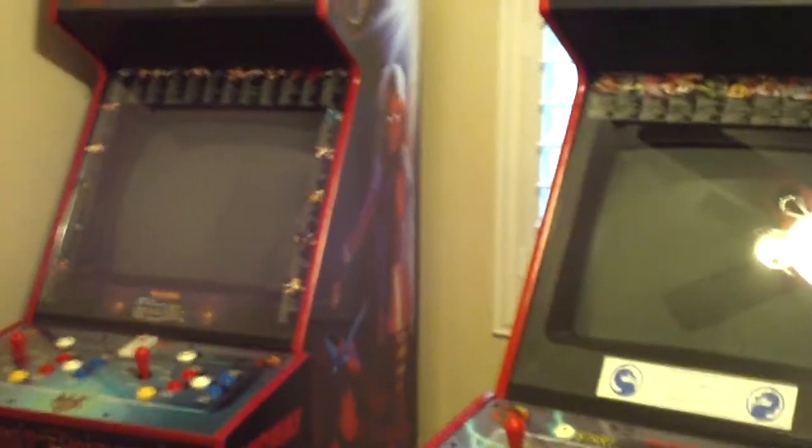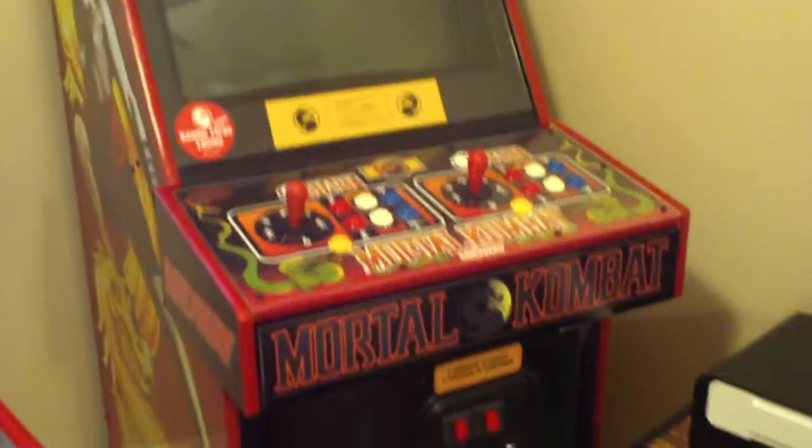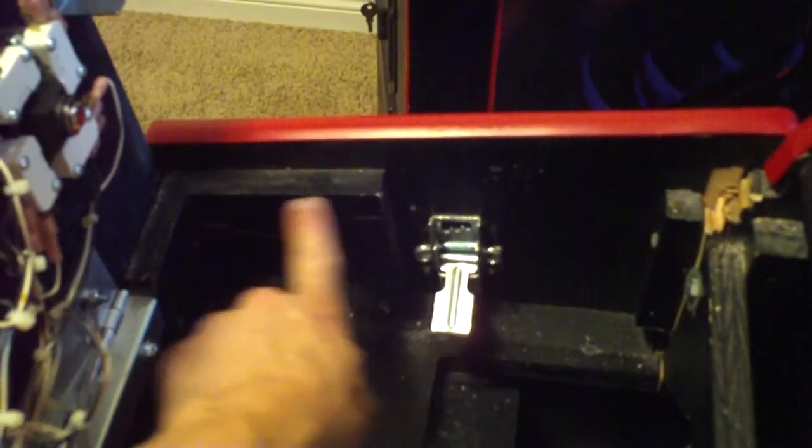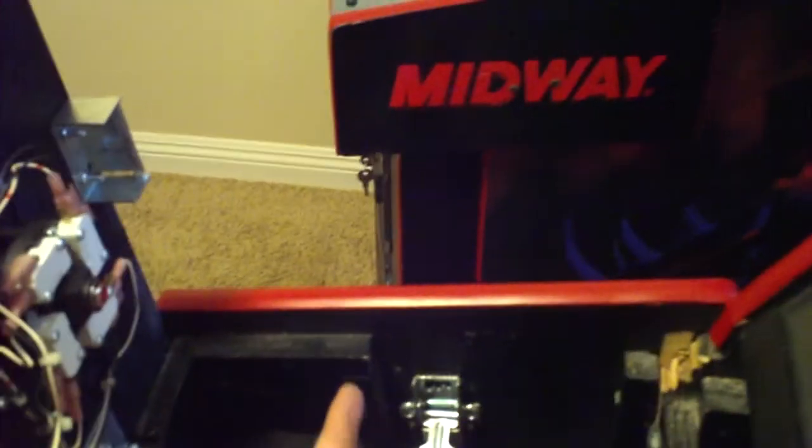But for informational purposes, the control panel is put together with an air gun, I'd imagine. That's the way I'd put mine together here. I actually took the old control panel apart, and there's just little brads in there from a nail gun, and glue. If you look inside here, there's little tiny blocks that support all the weight of the control panel, and the control panel sits on top of here, and these are air bradded in here, and here, and in this corner, as you can see.